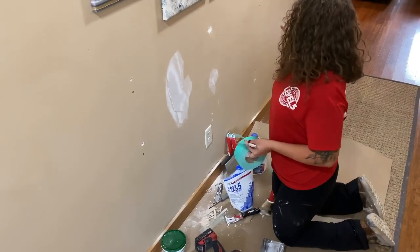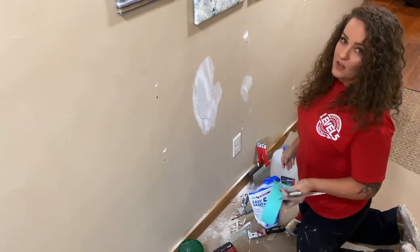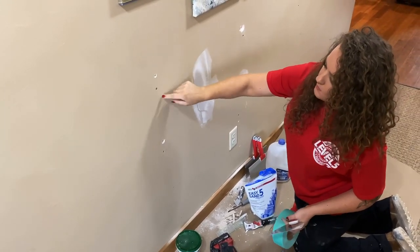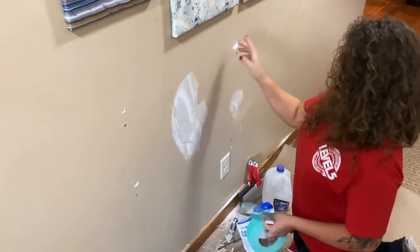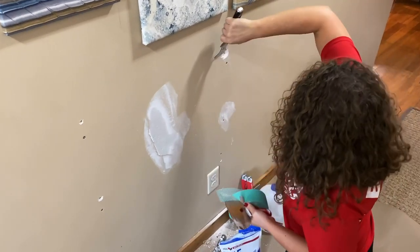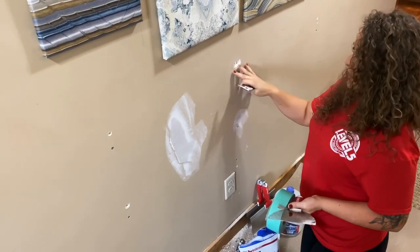While this was setting up, I went ahead and took out the rest of the popped screws on this wall — kids and hoverboards are why this happened. We took out the screws and put new ones in, staying in the same row but coming a little bit underneath, not setting deep, just where they're supposed to be. We reused the same screws. You can take your 5-in-1 and clean up your patches and holes — it has a sharp edge so you can scrape, make sure everything's flat, and remove any loose or blistered paper.